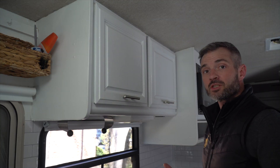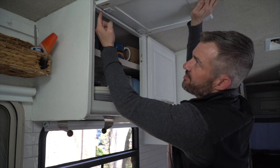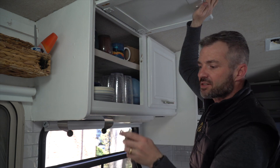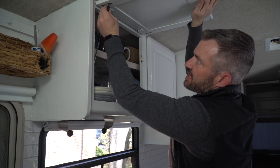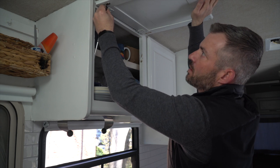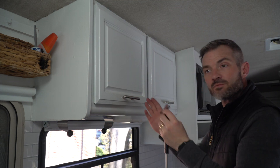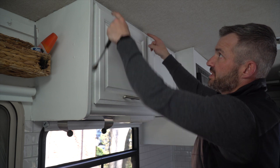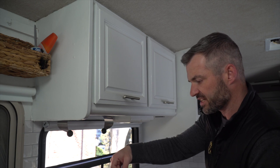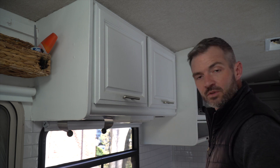Now that we've got a bunch of the hardware removed, the next step is to mark 2.36 inches from the back edge of the cabinet forward. That's going to represent the dead center of where this hinge is supposed to fall — that marks where we want this. Then we're just going to eyeball in and out about where this needs to be so that it'll clear the door when it closes, and replicate that on each side. 2.36 inches to the front — just under two and a half — we'll go with that and see how it goes.